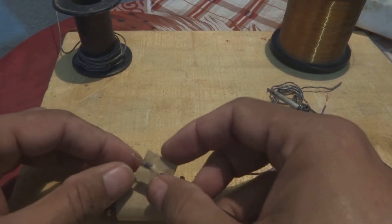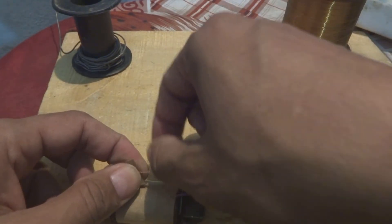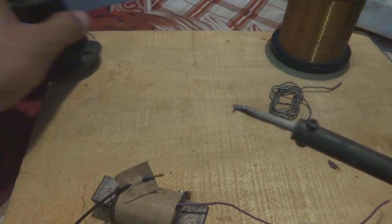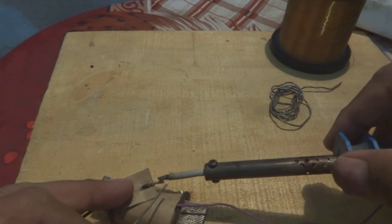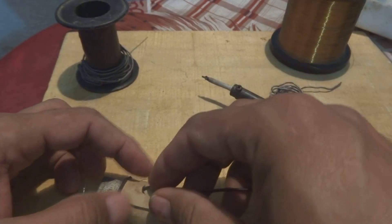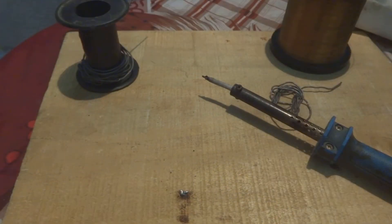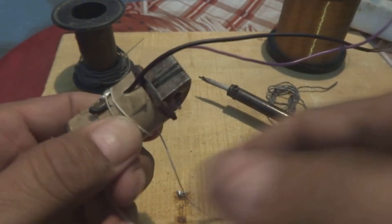We are going to wrap this wire, which is coming out of the winding, on top of this bare copper wire or hookup wire. Now is the time to solder this one. Using our soldering iron and soldering wire we are going to solder this winding end wire — we are going to make it a little bit turned so that it will not come off easily. We should have to secure this using our cotton thread — we are going to secure this end connection over here. A few turns of the thread will be enough to make it secure. We will make a knot to this thread so that it will be securing the terminal safely, and the rest of the cotton we will cut down.